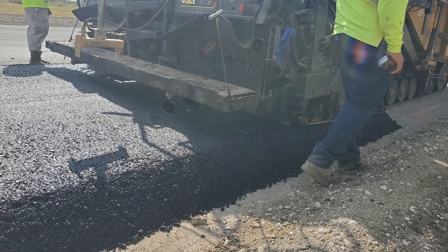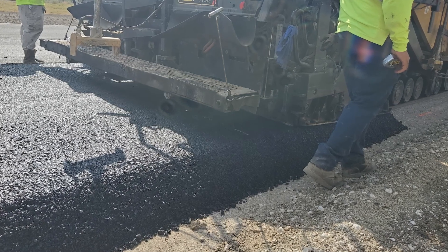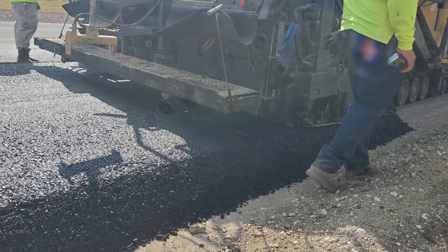The tamper bar paver did give more uniform air void distribution throughout the depth. However, when placing eight or even ten inch lifts, the top tended to cool off but the inside stayed warm for a very long time. This meant the road still had to be kept closed to traffic for eight to ten hours until it cooled off.